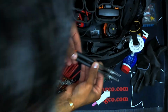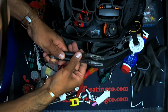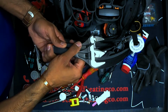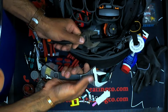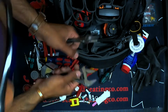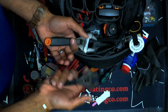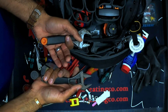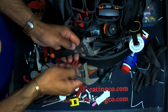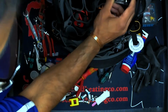I do have the 8-inch in the van in the extra additional toolbox, just in case I need a bit more leverage or for a wider head for 28mm. But I very rarely come across 28mm pipework in this country. As you know, I work mainly in apartments with combi boilers on 22mm or on flexible Uponor MLCP pipe, which is 20mm. So I don't really need anything bigger than that on a daily basis, but I do have them in the van should I need them.